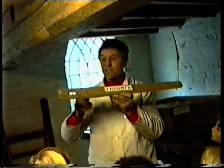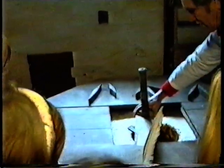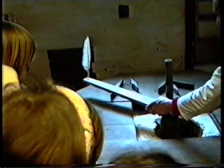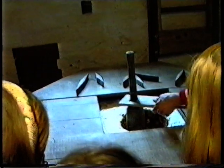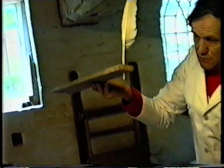So the shaft that turns the stones, this is what we do, watch it. Just stand back a little bit. Imagine the shaft coming up through the floor like that to turn the stone. We put this on the top and we turn the stone round like that. As we turned it round, it went round the outside edge of the stone. When I take this top stone off, I put it round on the goose feather. That little bit at the bottom actually touched the top of the stone, and it scraped it all the way around. It's to tell you whether the bed stone is level, because if it isn't level, and the stones go around, you get a lot of vibration, and the tiles start to rattle on the roof, the furniture and everything rattles. So it must be level. So that's a trammel for a levelling device.